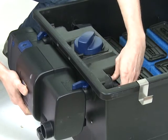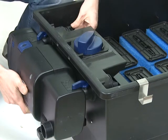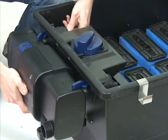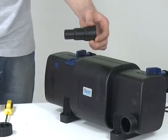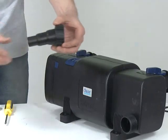The Bitron must be fitted in a horizontal position with the feet downwards. Direct sunlight should be avoided. Only connect the power supply to the Bitron C when water is passing through it from the pump. To connect the hose to the inlet of the Bitron C, ensure the stepped hose tail is cut down to the correct size for the hose diameter being used.